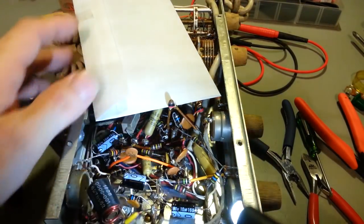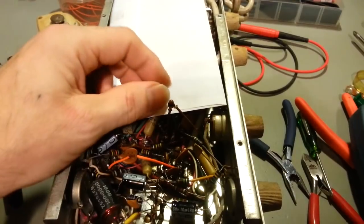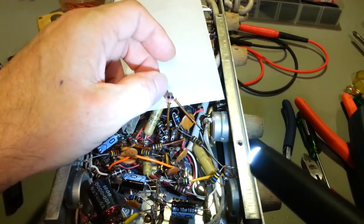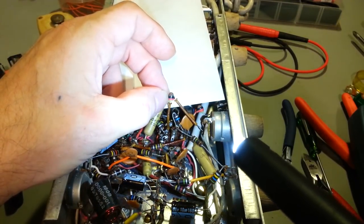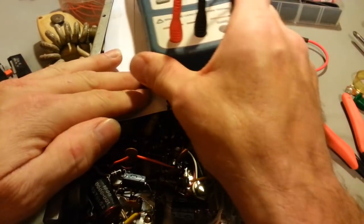But it's definitely not, and if I test it, now that would come out to brown, black, red. So that would be 1-0, normal color banding scheme. So 1-0, and 2 is your multiplier, so add 2 zeros. That would be 1,000 picofarad, or 1 nanofarad, or 0.001 microfarad.